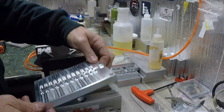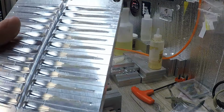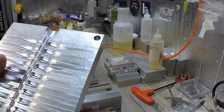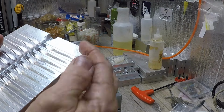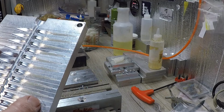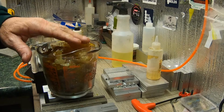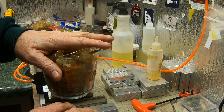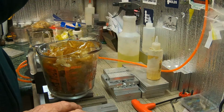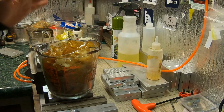Now I got to put all these in all the molds like that. Yep, tail's ready. Now I try to make sure they're to the end. See how easy they are to move when they got oil in them? Now I didn't put a bunch, or else you notice I put one drop and just rubbed it back and forth. That's all it takes. Just enough to get on this end where you can move them around a little bit. Alright, guys. Like I was saying, I've been watching all these shows. I watched a lot of YouTube. And I've seen another guy the other day, he was using spray oil. So, hey, I'm not the only one.